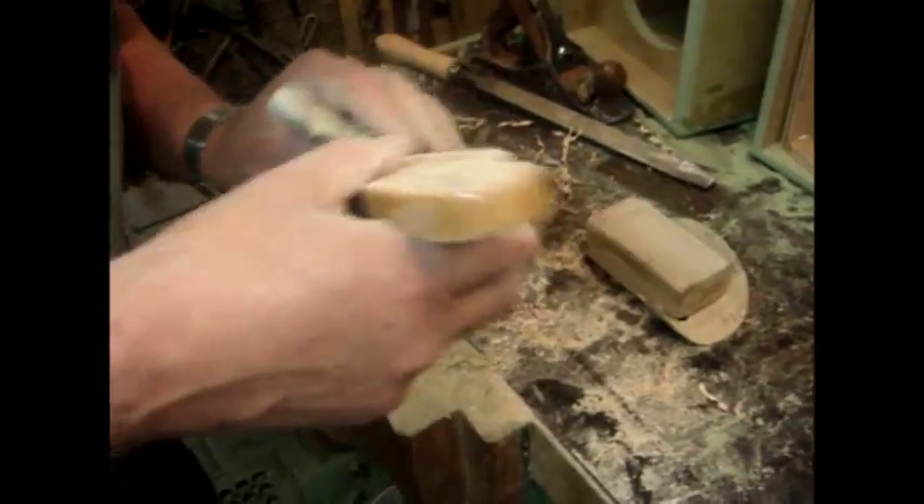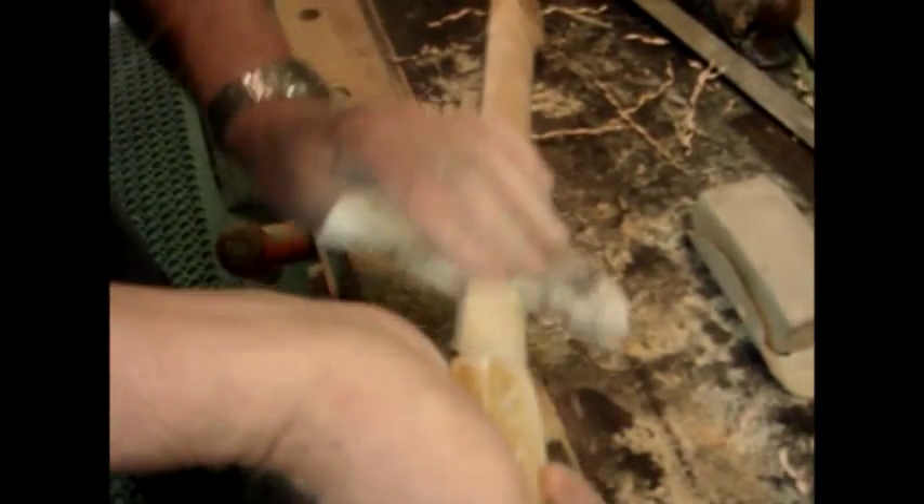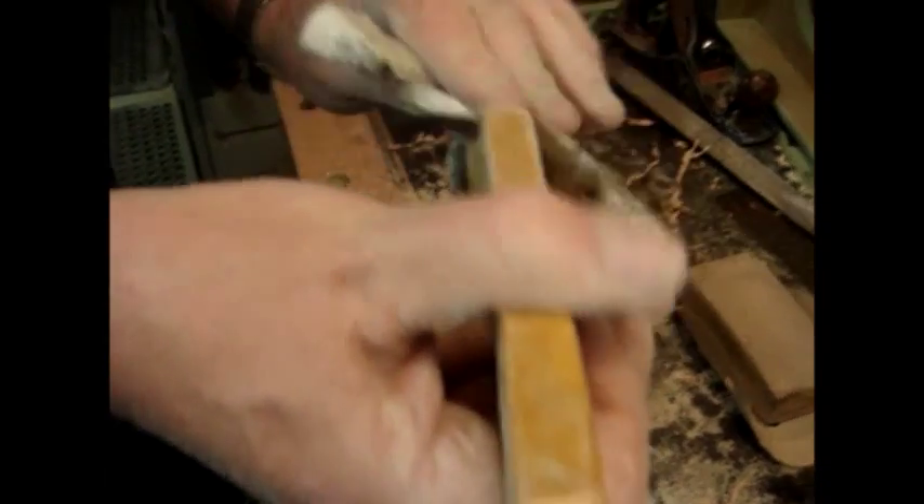I've got loads and I'm not being stingy - I just want a softer finish. We're sanding down quite a nice lacquer here just to bond in. Really clean it with something before you actually spray it - just white spirit.